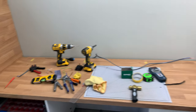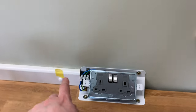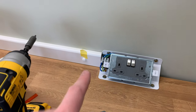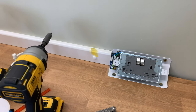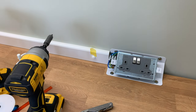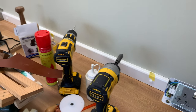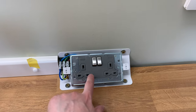We are nearly there. I'm just finishing off this piece of benchtop here. I fixed that up just with some screws, which is why there's screw caps. I don't really like screw caps because they don't look very neat. I didn't want to start sticking that to the wall because if I ever need to replace these worktops, I don't want to start ripping all the wall to bits. I made that mistake in the other workshop and the grab adhesive made a right mess. So for the sake of seeing three white screw caps, I can just easily take that off if I need to.